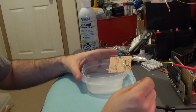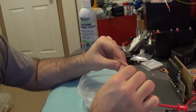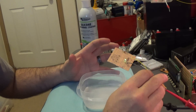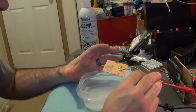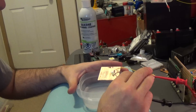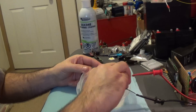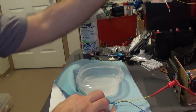I'm just going to throw this in this water here real quick to show you the power of conformal — though this is not what conformal coating is used for. This is actually water with some salt in it, just to increase the conductivity of the water, because in plain water this does not work — at least not in my water, and definitely not in DI water. Here we go. LED's on. LED's not on — I tripped my current overload.